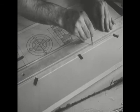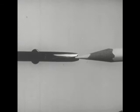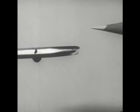The nibs are split so that the part away from the straight edge is as wide as the required line. The inside of the back or guiding nib is shortened, and the front nib is cut away to keep the ink from running under the straight edge.